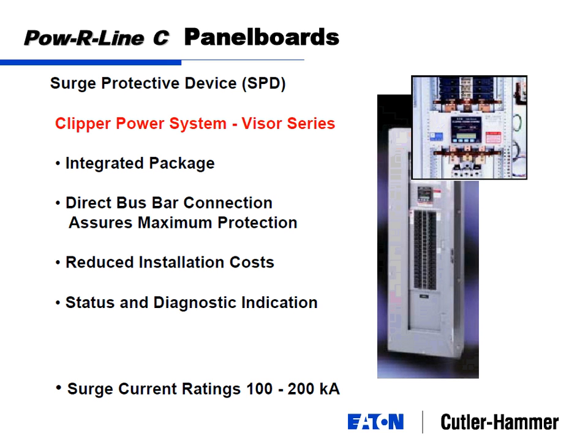What we've done, and I think a lot of manufacturers have done this, is put in indicator lights. This is an older style, not our newer style, but our newer style now has, say, three green lights. Three green lights are constant, so you don't ever have to go push a button and check, is it working? When one of the phases fails, whether it's a lightning strike, a lot of internal transients, or maybe a manufacturing defect, then one of the lights or all the lights will go out or turn red. So when the light turns red, then it's call up so-and-so right here and replace it.